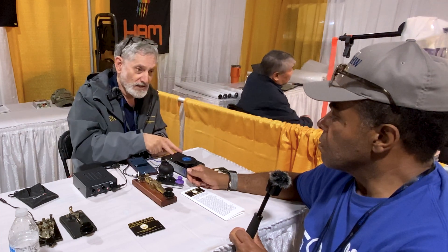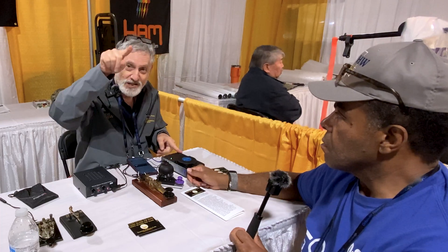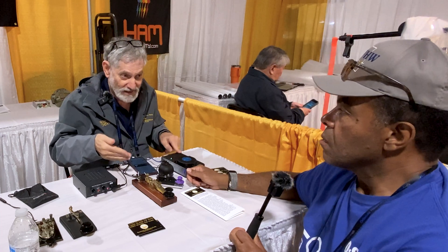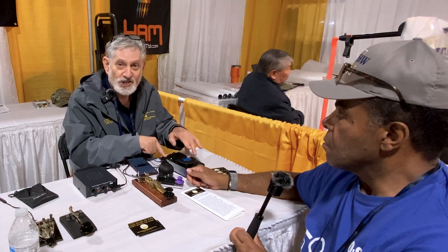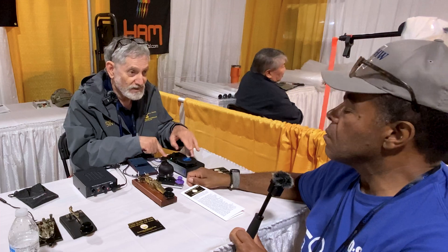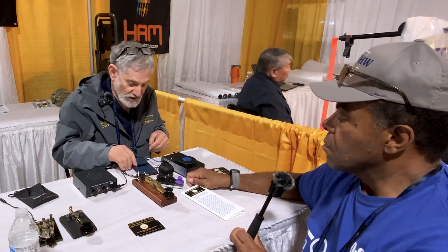The other side of the box takes the output of that filter — CW present, not present, present, not present — that's a digital signal at that point. That digital signal drives the LEDs and it drives the shaker speaker. This is just a speaker that might be found in a home theater system, but it's for much lower frequencies and vibration more than sound. So let's bring in a signal.